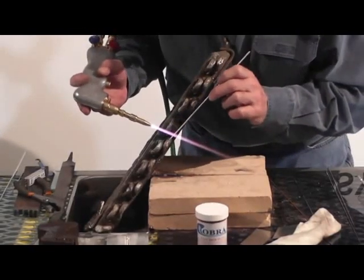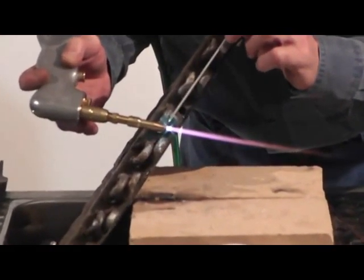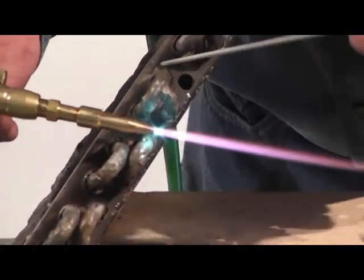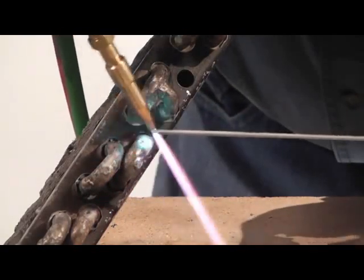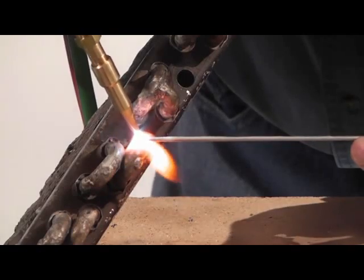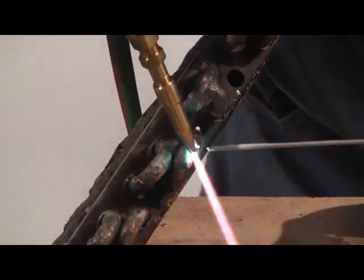We're going to weld this little aluminum cube up here on this little heater coil. I made the cone just a little bit longer than it was when I was welding the aluminum flat. Got the flux on my rod right here, still using that 4043. Go down and preheat it a little bit, then put the rod down, and put all the heat on the rod until it flows, and just sort of pull off of it real slow.